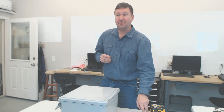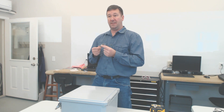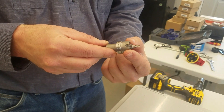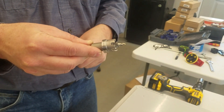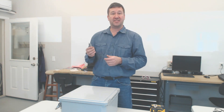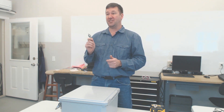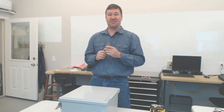Instead of a hole saw I use a hole cutter. It's nearly the same thing but it's a whole lot more beefy. It has a center drill to get the hole started and carbide teeth to cut a fast, clean hole, and there's even a spring to push the slug off once the hole is drilled. It takes about three to five seconds to drill through mild steel and maybe 10 seconds through stainless steel, plus it cuts well through fiberglass. I've used a lot of different brand hole cutters and my favorite is Ideal. In fact, they should be giving me some samples for saying that.